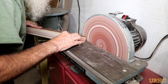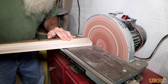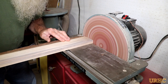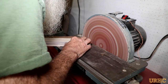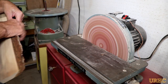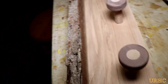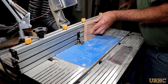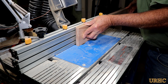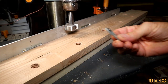I wanted to put some big radii on the ends of this little shelf, and the only way to really do that with the bark on the edge is to sand it on carefully — the bandsaw would just rip that right off and shatter it. Once it was sanded down pretty well I put a coat of polyurethane on the bark area before polyurethaning everything else, just to start hardening it up. Then I put a little chamfer on the bottom of the main board just to make it match everything else.